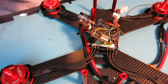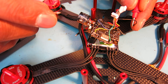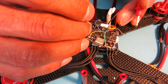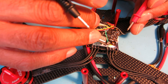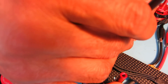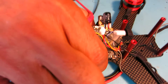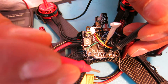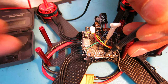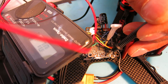Let me get out my continuity tester. If I touch positive and negative — the pads are all covered up with glue, but I can get through. I'm touching the ground here, and right next to it is the five volt pad for the LED panel. There was a beep there. Let me put the ohm meter in shot so we can take a look at the number when it pops up.